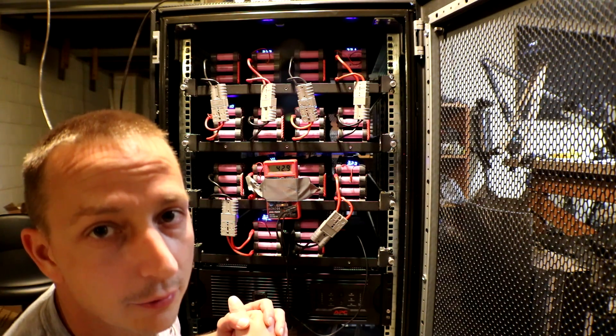I reviewed the footage and it was 41.7 volts at shutdown — that's not too bad, I guess. But that one pack is really, really low. I'll probably pull that pack out and check all the fuses to make sure I didn't break any when I was connecting and removing the Anderson connectors. Hopefully some fuses are just broken and not making a good connection, and I'll report back.